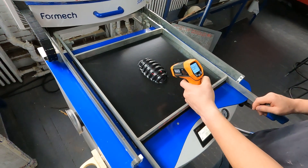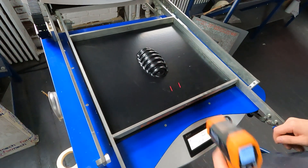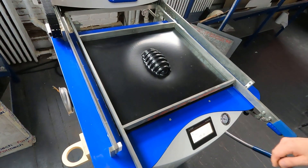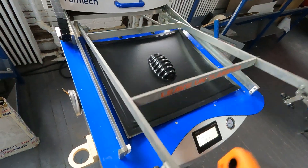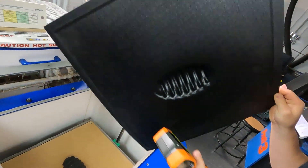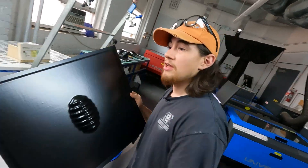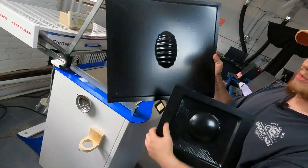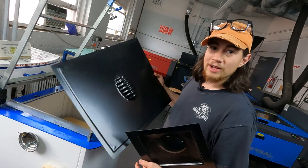I'm going to hold the vacuum until this is completely cooled off — I want it to be below 94 degrees. A few degrees below — I can release the vacuum. I'll give this a few air puffs to help separate it from the mold, then bring the table down. My mold went with my table. I got a perfect vacuum form here, and every single one of these will be exactly the same. The other big benefit is there's no lip around the edge — it's completely flat and there's no wire mesh texture. It's completely smooth. That's how you vacuum form.